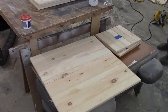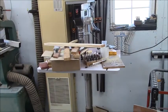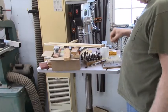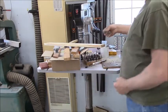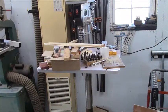What I have left to do next, before I sand and finish — feels good to get the earplugs out — I have to clean off my drill press and set up my 35mm bit for my pocket hinges. Here's the jig for the setup. Once we get it set up with the fence, we can bang them off in a hurry.